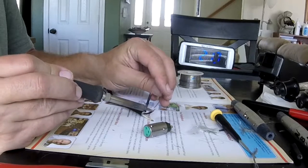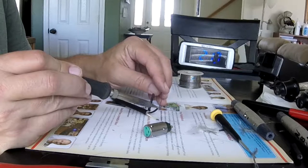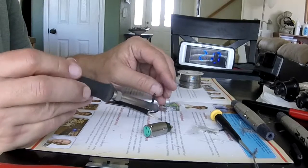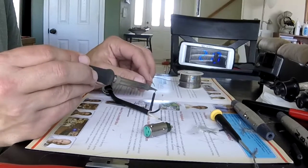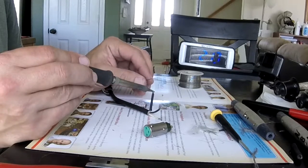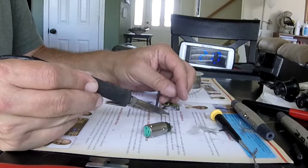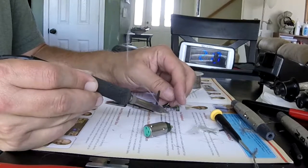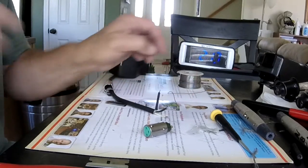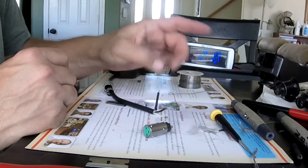This Weller is one of the best eBay purchases ever — about 15 years ago, 20 bucks, about 99 new. You need to get just enough solder on here so that the leads get tinned but you don't have too much wicking. Wicking is where the solder creeps up into the wire and can make it stiff and more likely to break.